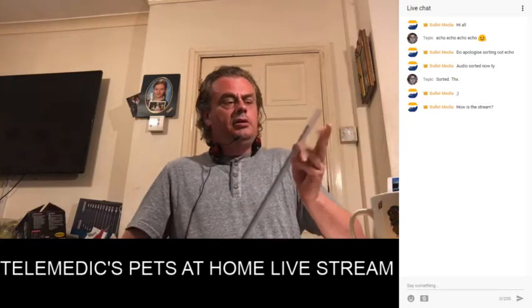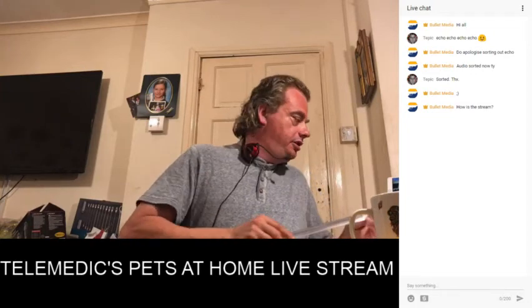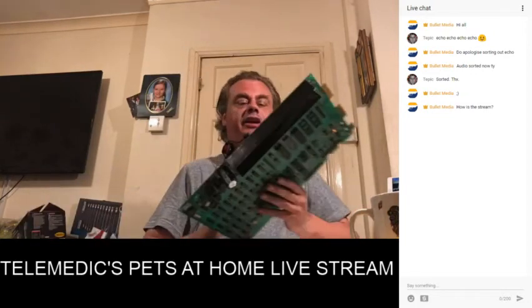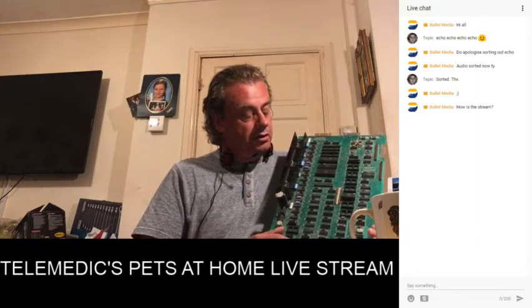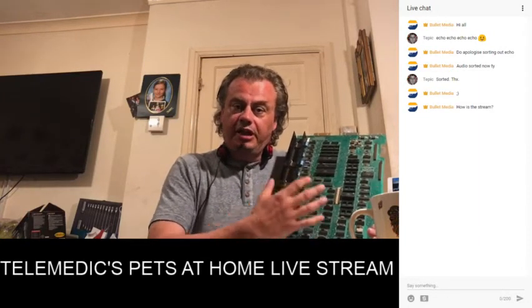But from what I can see, in this particular setup, there is a lot of glue logic on the original PET board which we have here. And a lot of this logic is only necessary because we're using dynamic RAMs and ROMs that were of very small size. So a lot of things were needed for, say, addressing small areas together to make one big memory.